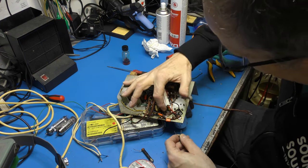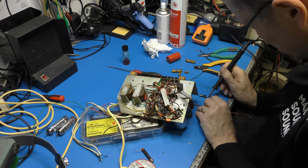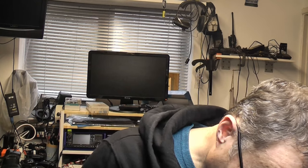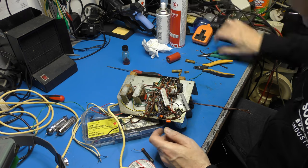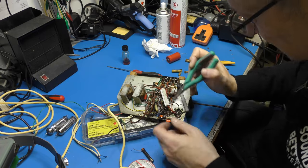So I need to go between that pin there and that pin there with my capacitor. Certain guitar amps, like the Fender Champ, didn't actually have cathode bypass capacitors. It takes the gain down, but it gives them a little bit of colour, I suppose. But if you bypass the cathode, it does bring the gain up. So when we say bypass, all our audio is going down the capacitor whilst it still has DC flowing through the resistor. The cathode under DC conditions is slightly above ground, but under AC conditions isn't. It's as near to ground as we can get it using a capacitor.